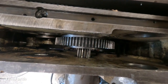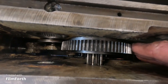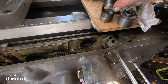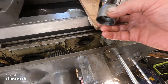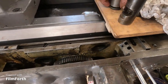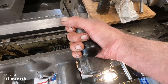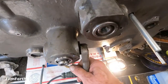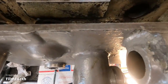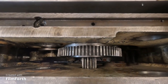Now we're looking down into the apron and this is the longitudinal clutch. The way it works is there's this cam here and this part of a thrust bearing housing that rides on there. So when you take one of these very heavy levers and put it on here, you get a key like that. When you actuate it, you can see that cone go in.